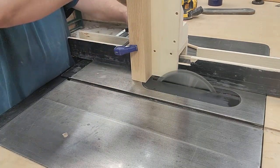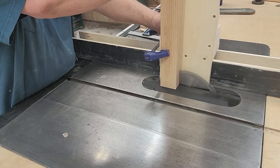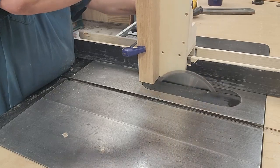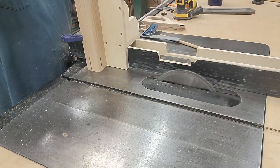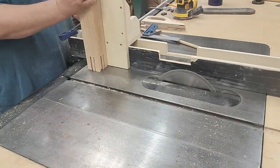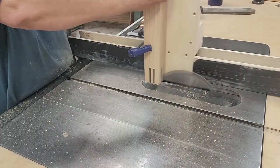We'll go ahead and cut our third to the inside of the fence, leaving the center section — the third to cut out. Cut this to the height of our material, which will make it sit exactly flush on top of the castle. We'll turn it 90 degrees and cut all four sides this way. Then we'll step the blade over 1 and 1/8 of an inch and nibble away more material so we don't have to take it all off with the chisel.